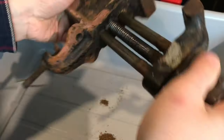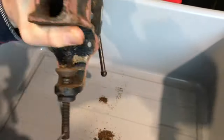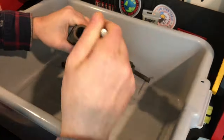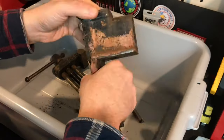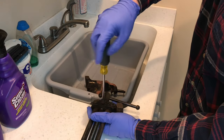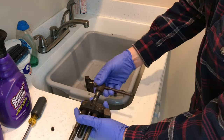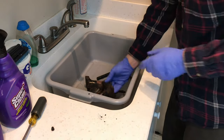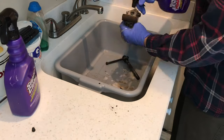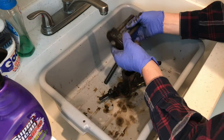As you can see here, that threaded screw is just gunked up with probably 60 to 70 years worth of old crusted-up grease. So even when I had it all the way out, I still had to bang out those two support slides to free it up. What I like about this vise is it actually has that little screw there, and that holds that lead screw that allows the jaws to open and close. That's much better than those rings that I've done in the past. And here I am just cleaning up that 70-year-old crust, using Super Clean there.